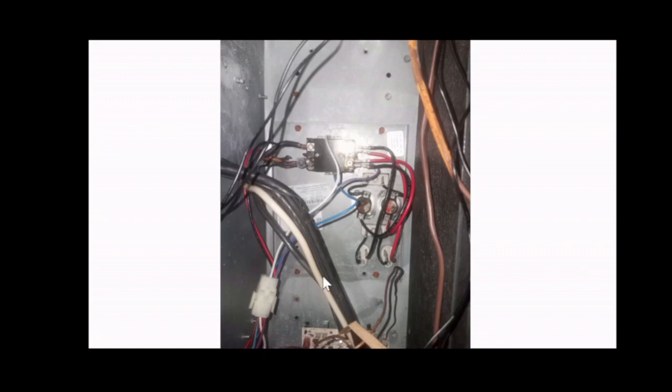Before you remove any component like the relay board or any other component that has a few connections, make sure you note the connections, label the connections if you can, draw the connections or mark the connections in one way or another. In my case, I did both. I labeled each wire and I made a small diagram sketch that tells you each connection, just in case anybody else needs to in the future replace that relay or work with this relay in any capacity.